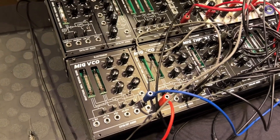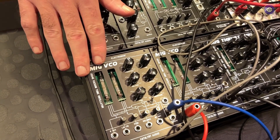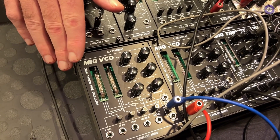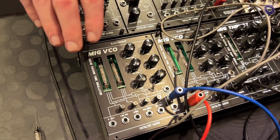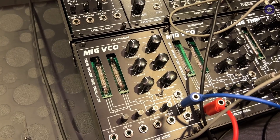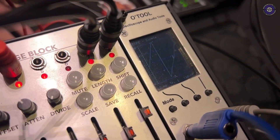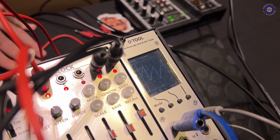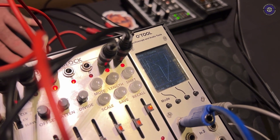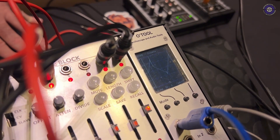What you're hearing right now is the VCO. These are particularly interesting because the VCOs function as a multivibrator by flipping back and forth between the tubes at audio rates. So each tube contributes half of the waveform. If you take a look at the scope here, we've got a sawtooth wave, and by turning the balance control I can flip between the different types of waves — it essentially works like having a wave shaper within the VCO itself.